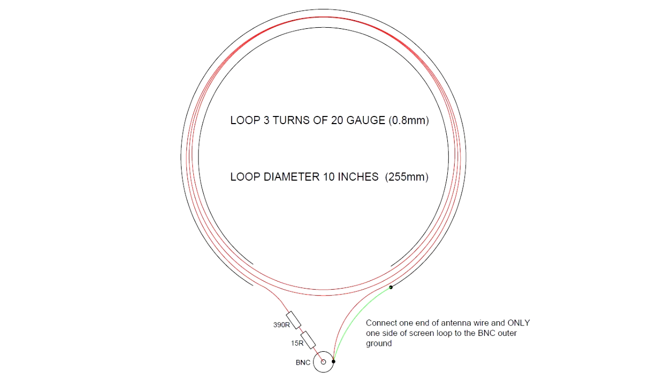So what I'm going to do is replace our brass loop. I'm actually going to screen our coil, our windings, using just aluminium kitchen foil. So I'm going to show you how to build a loop using aluminium kitchen foil rather than using a brass or copper tube, and hopefully it will still work just fine.